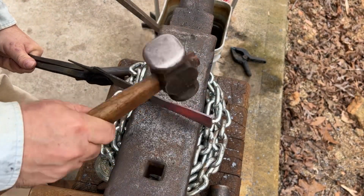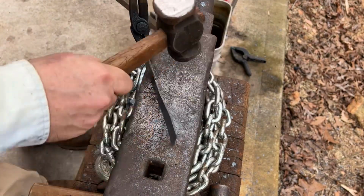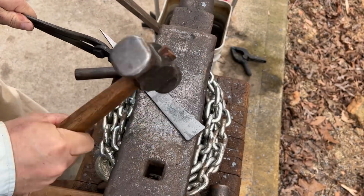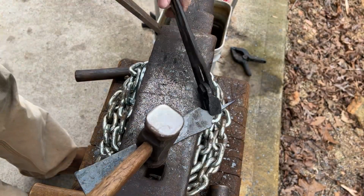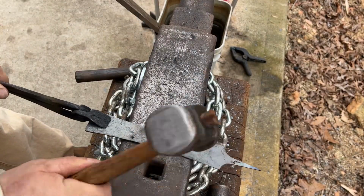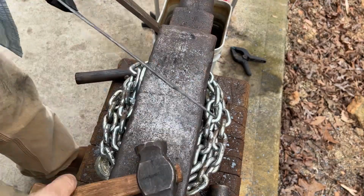With the blade forged, we can move on to forging the handle. Since the handle is raw cut steel, it won't be comfortable to hold, so we need to round the edges over. This requires 2 steps. First, we want to break the edges. This is hammering on the diagonal, which rough chamfers the edges. We have to do this for the front and back of both sides. Then we will work the edge faces to flatten them, and this will take a couple of heats to complete all this.